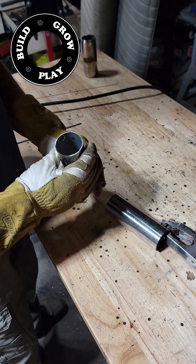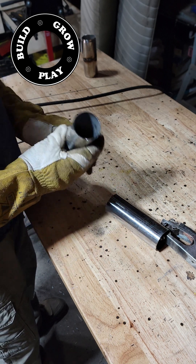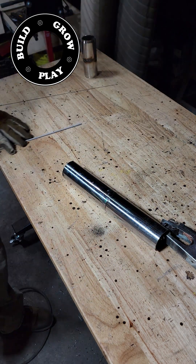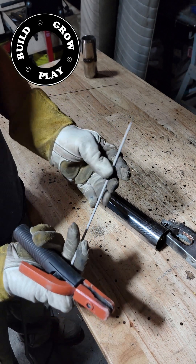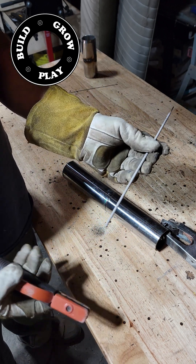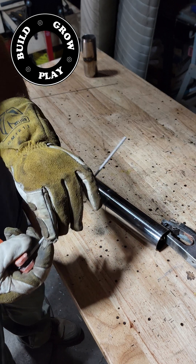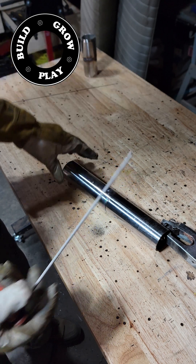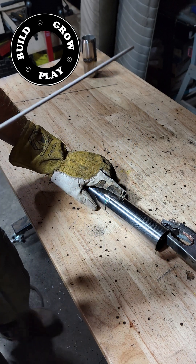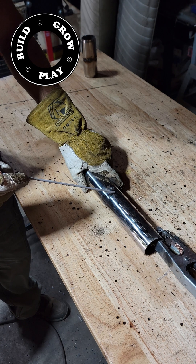The question I pose is: can you stick weld stainless steel exhaust systems? TIG welding does a beautiful job, but there's the extra cost of the machine, the gas, and the gas line to purge the exhaust system. I don't have a MIG welder, and again it's good to purge the system with a MIG welder, but I've spent many years welding stainless steel pipe for large applications and a stick welder does a great job. So here we go — I have a 2-inch 304 stainless steel tube exhaust system here.